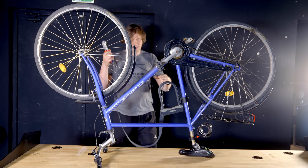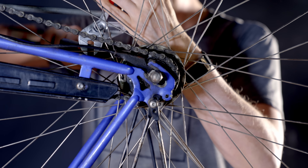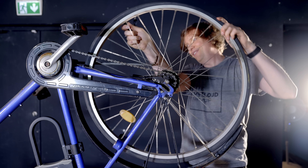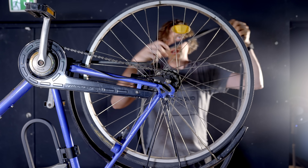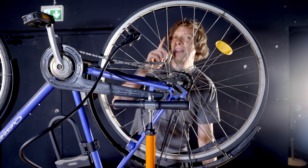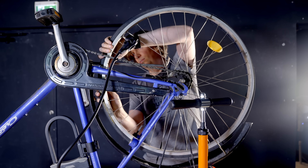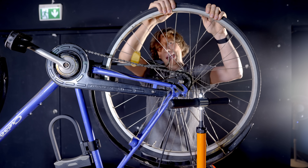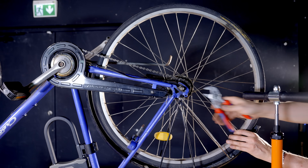I've been riding the subway in Stockholm the last week because I had a puncture on the back wheel — let's fix that. I become a happier person when I'm riding bikes. I remember fixing my first puncture as a kid, doing it myself without my father helping — I was immeasurably proud. At this point of a puncture fix, when you're trying to fiddle with the empty tube, the trick is to give it just a bit of air, because when it has some air it's much easier to get it into the wheel correctly. And for the last step when snapping over the tire, when the tube has some air in it, the tools will never pinch the tube. Great tip. And the puncture is fixed.